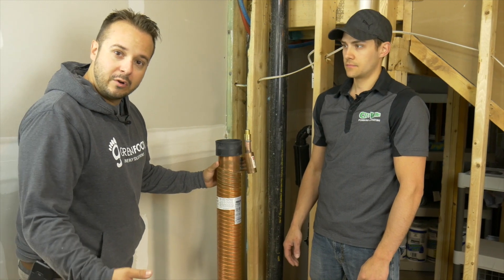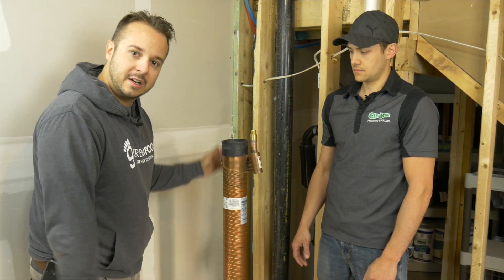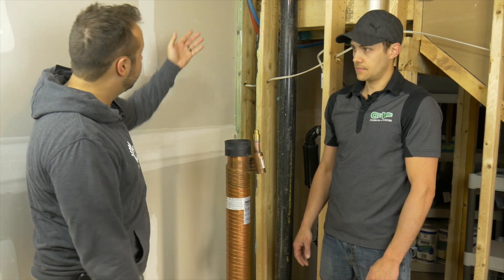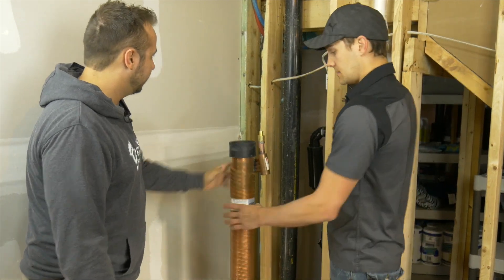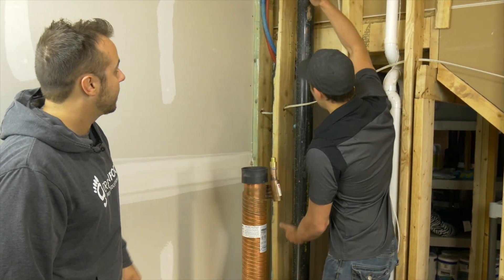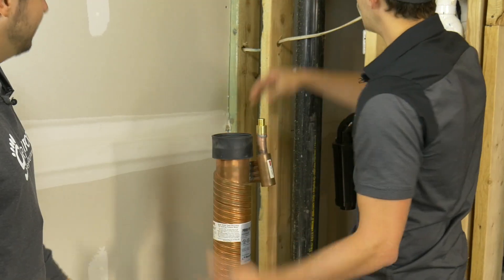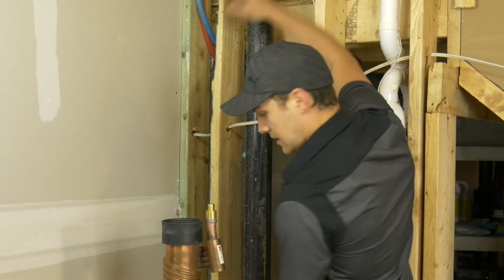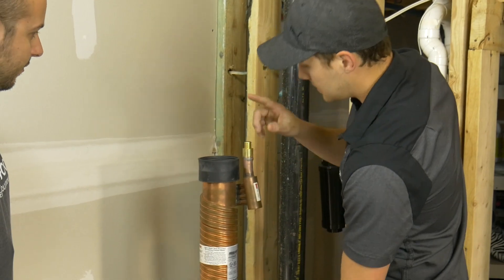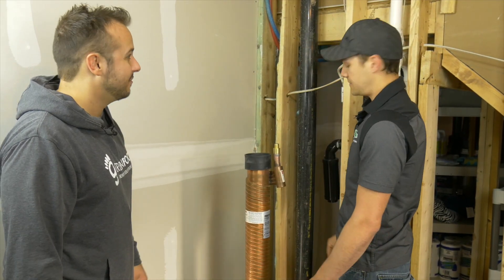You're going to recover from about 40% to 60% depending on the pipe size. This is the actual main drain stack. So how are we going to do this? It's the fun part — it's so simple. We have to cut the pipe to length, and then there are two MJ adapters. All we do is slide that in, then hook the cold water on the bottom, and the out is going to connect — and that's it. Simple as that? Fairly simple.